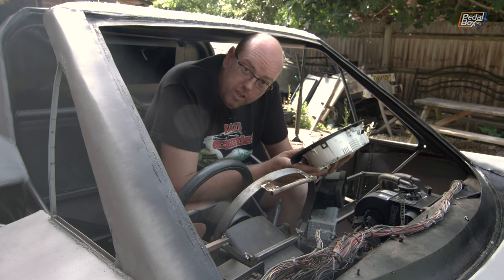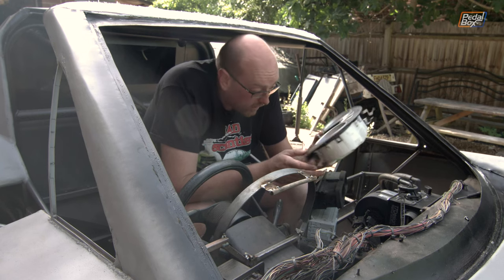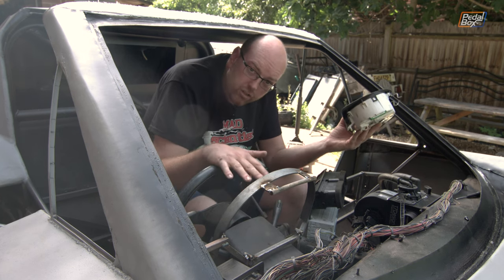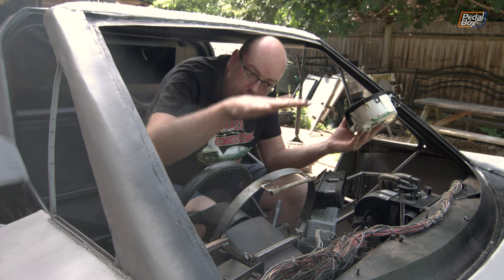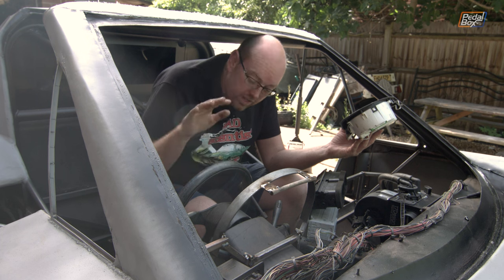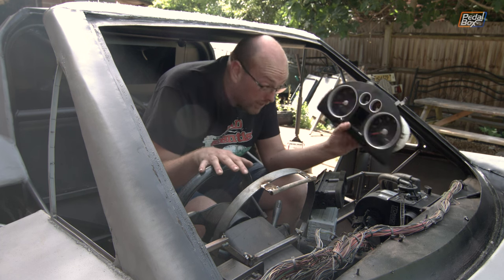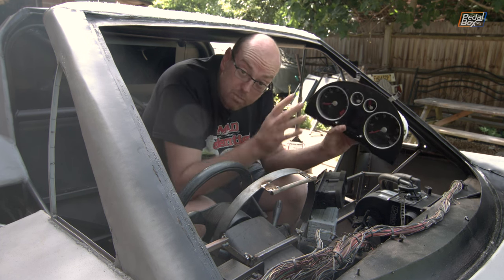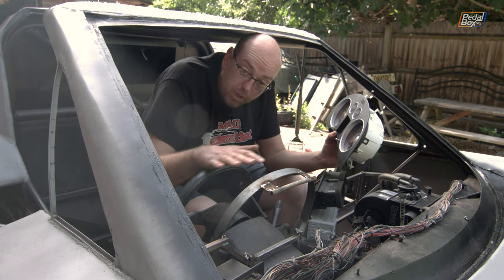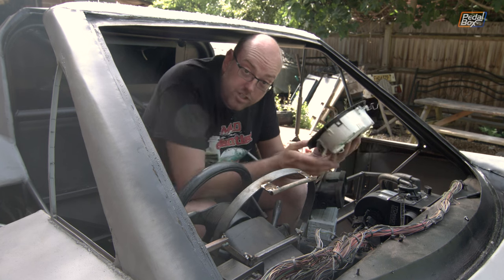In the dashboard we've got a couple of important pieces to locate, and one of them is the clocks unit. This wants to sit centred above the steering wheel — not so much that it's poking right up into the field of view, but also not too low that the steering wheel obscures it. Because we have a much smaller steering wheel and this layout was designed for a much bigger one, there's always going to be some area occluded by part of the wheel depending on its position.